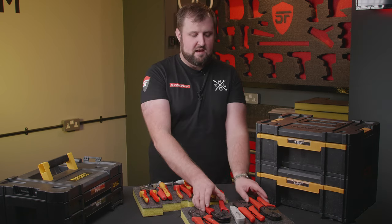We're going to use a steel rule — a standard 25mm wide steel rule — and make the finger pull 25mm wide. We hold it still, put the gloves on, and once we've got it marked up we just run the scalpel along each side to create the finger pull. We're not running it to the edge — just like that. Then we take the finger pull right down to the base layer so we can get our fingers comfortably underneath the tools. We then chase along and pull out those little pieces of foam.